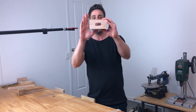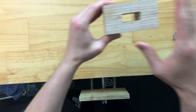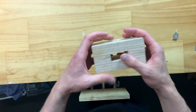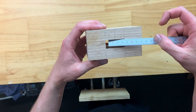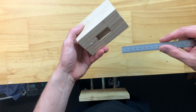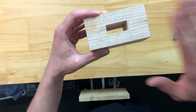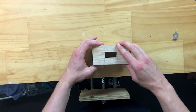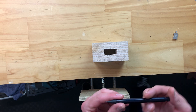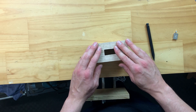As you can see, we've got our mallet and it's got a nice mortise going through the center. The next step is to figure out which is the top and which is the bottom. Just grab your metal rule, come across and measure to see which is the largest — that's sitting at 42 mils and this one is sitting at 39, meaning that this is the top of my mallet. From here we're going to mark on top — T-O-P — so we know that this is the top.